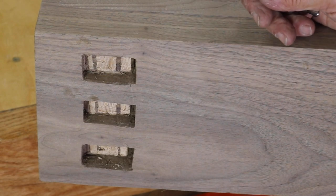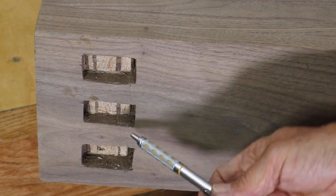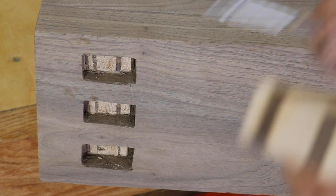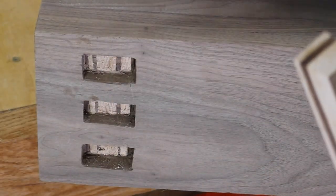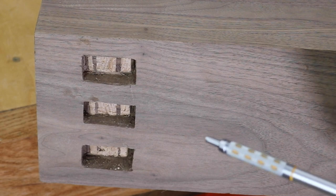Here's where I am in the process. I've cleaned all these out with the Forstner bits and chisels, got them as square as I could. They're larger now than before, but that's okay. I've laminated a bar of the piece that's going to go in there to make it look like a spiked tenon. It's all secure and stable — I've got quite a long tenon so I'm not worried about the joint failing. This is just going to be cosmetic.